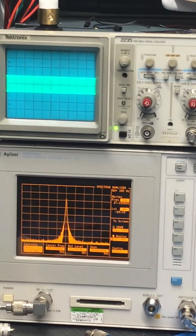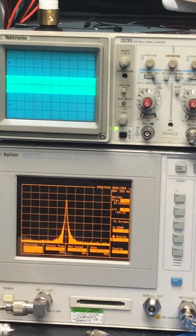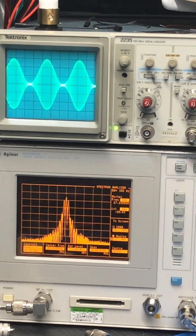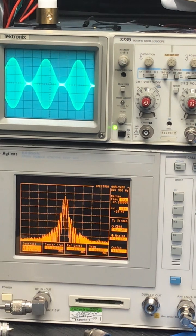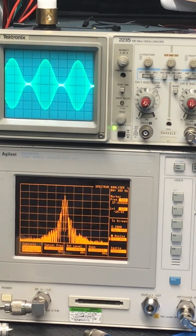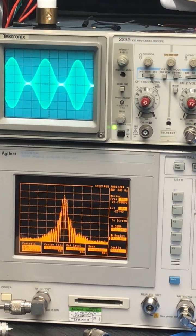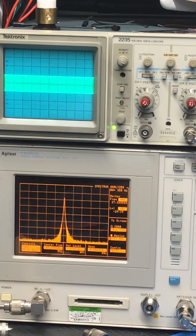All right, so that's about 1.5 watts dead key, and that's with a tone, so that's probably about 20, 25. With the microphone, she'll jump up around 20, 25. Beautiful on the scope. Okay, that's positive peak expansion on the radio all by itself. Okay, so now we'll flip over to the amplifier,